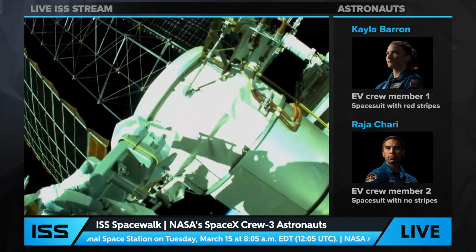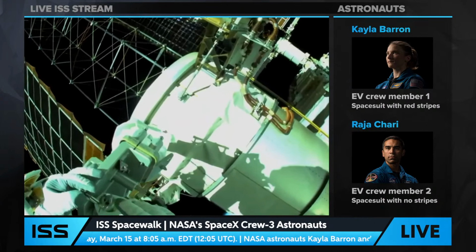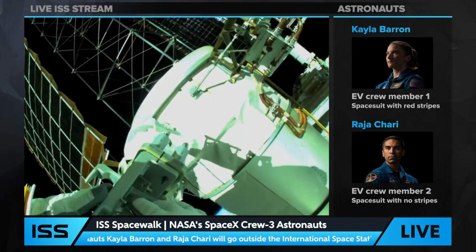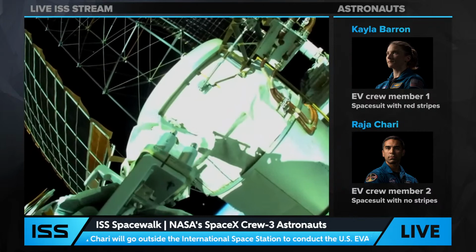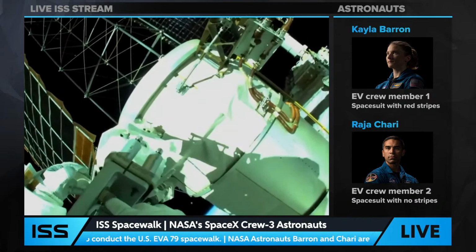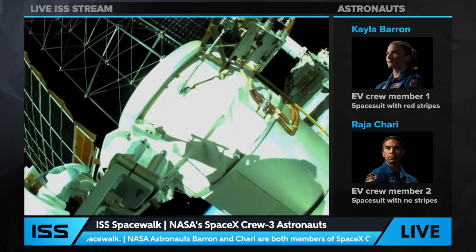Working on this upper grounding dip pin while she's doing that. This is at an odd angle, so I'm still struggling to try to get into the grounding block. But I know it's only getting harder once you drop the bolt. Copy. Yeah, it looks like that cable's got a little memory making it hard to line up. And you can go in from the other side, that other hole. As long as they both are in the grounding block, that's a good config. Yeah, this one that's facing towards me, I'm saving for the mid-strut, because I think that's even harder to get around the corner with. Okay, copy.